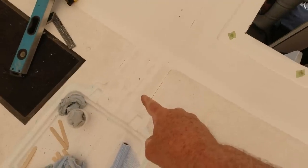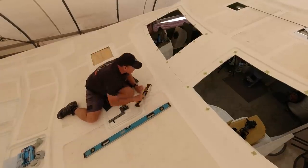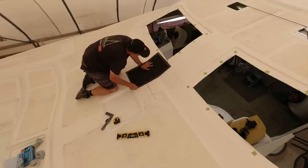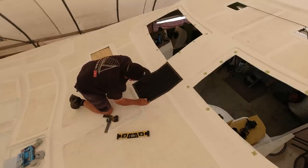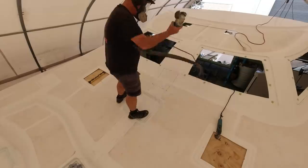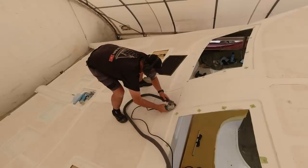I've used every tool I've ever owned for this. I started with a couple of drill holes through the deck to find my starting point, then onto a 125mm grinder, then the oscillating tool, back to the drill, and then onto the jigsaw — all needed because the curvature of the deck created its own very special set of problems. As I wasn't able to get through the required depth with the grinder I needed to move through each tool to ultimately cut it out. It ended up being a bit of a bastardised effort, and then I realised I'd cut the hole too small because I'd been reading the product code number wrong on our quote for the mast and rigging setup — so I had to remark and recut the whole thing again.